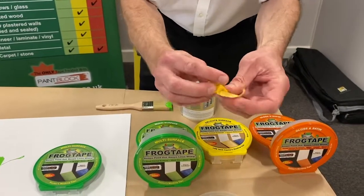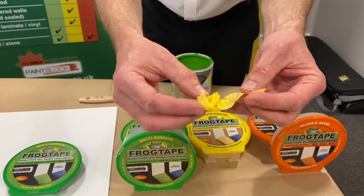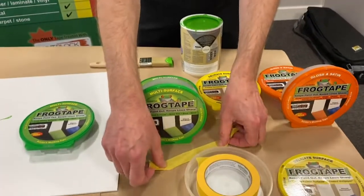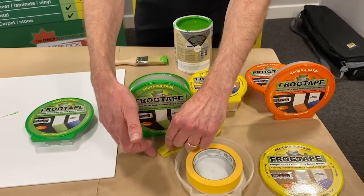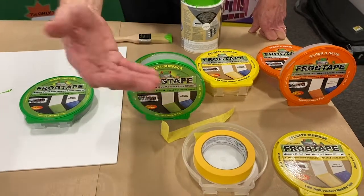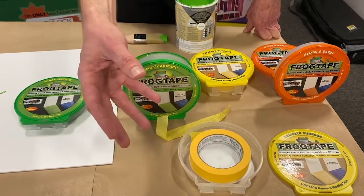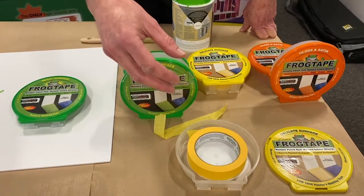Again, you should remove the tape while the paint's still wet. To prove this is a low tack delicate surface tape — if you did that to a standard masking tape, you'd never get it apart. But the adhesive always stays in the tape and therefore it's gentle on the surface. A couple of little tricks: if you're getting a pull that's damaging the surface underneath, heat it with a hairdryer or heat gun — that heat will soften the adhesive and help the tape remove cleanly. Always test on an inconspicuous area first to make sure you have a compatible surface.